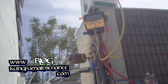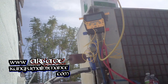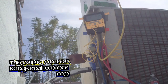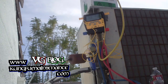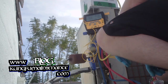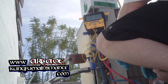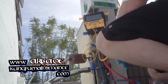Now we're at about 21 superheat. Our ideal is about 8 to 15, somewhere in that range, 9 to 15. That's going to take a while to drop down. It's pretty neat how we can watch it in real time. You can see as we're adding refrigerant, our superheat is starting to drop down little by little — so that's good.